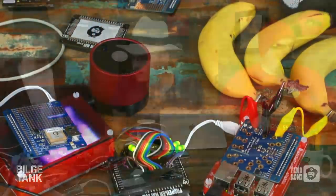Right, warm start. So with the GPS, when it switches off and you switch it back on and it's completely lost its memory, it takes anywhere between 5 and 15 minutes, maybe longer, to find where the satellites in space are. It's using relativistic principles to work out how long the radio signal, which is basically the light end of the spectrum, took to travel from space. And it's using that to triangulate its position on Earth. It's all really clever stuff, GPS. Unfortunately, the signal is below the noise floor, so finding it is really hard. So GPSs take this 10 to 15 minutes when they start up to find the satellites again.